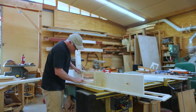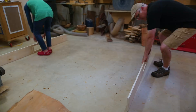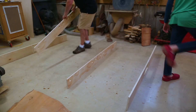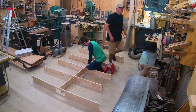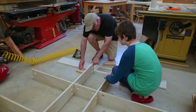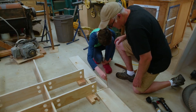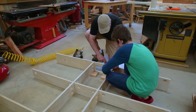Then we could start laying the structure out and putting it together. We put down the two ends and worked on the center — three cross pieces and two pieces running the length of the table on the inside that sort of fit together. Originally I'd planned for those internal joints to have no fasteners or glue, just going together with their own friction. Part of the design started with a six-inch-deep table, but then I made the sides an inch and a half taller — seven and a half inches — to give more room for the drawers and drawer faces.